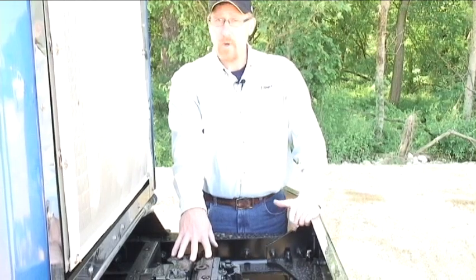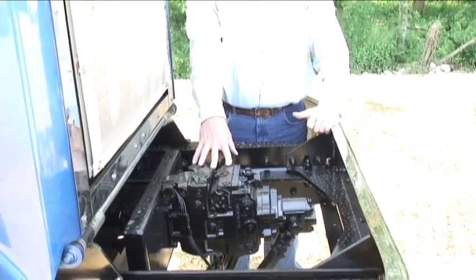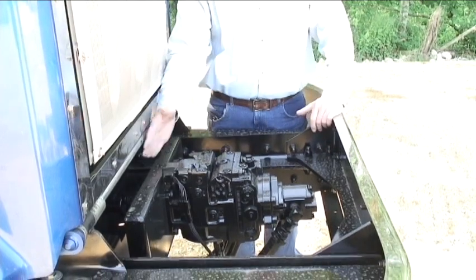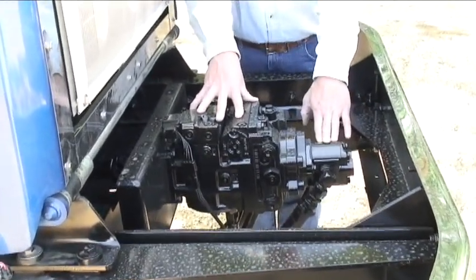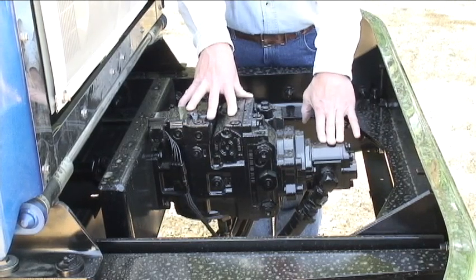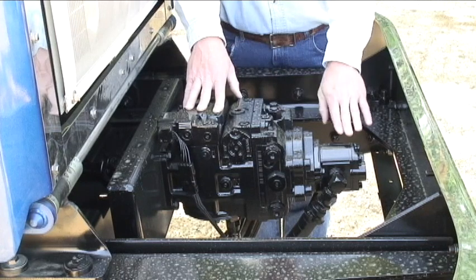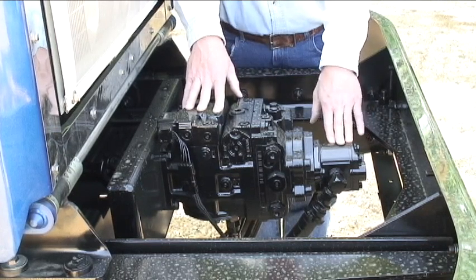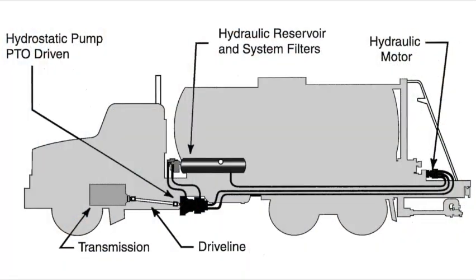On the front of the truck, we drive our system by crank drive or live power. By using live power rather than PTO drive, it allows our system to continue to run all the time whether the clutch is in or out, giving us instant starts without a PTO engagement delay. On crank drive, we're running directly off the engine with a 90 series hydraulic pump along with a smaller gear pump. The gear pump controls lift, shift, and fold of our spray bar separately from the main hydraulic pump, which controls the asphalt pump — allowing us to shift the bar, raise our wings, and fold the bar even while spraying without affecting the application rate.